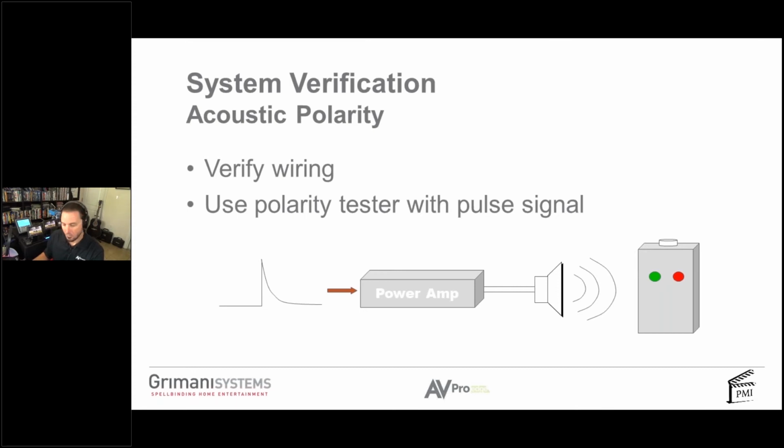And so if you start measuring and you see that the mid-range is out, don't immediately stop and think this thing is broken. Go measure other speakers in the room that have the same speaker. So hopefully at least you have a pair of speakers that are the same, the left and rights, or whatever, as you go around the room.